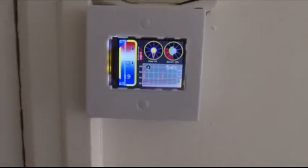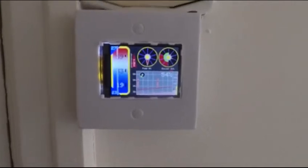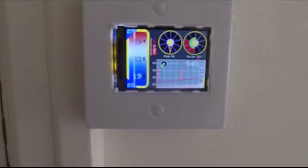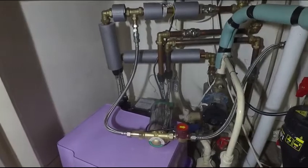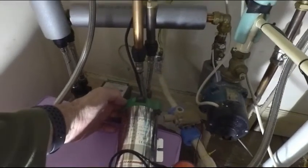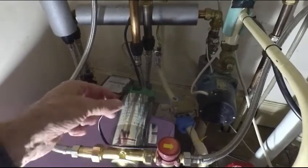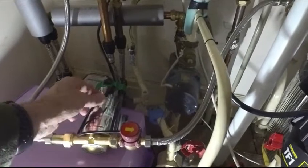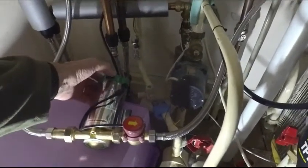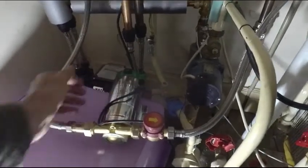It's now about midday. The sun's come out slightly more — it's still a bit hazy — but we're heating at nearly two kilowatts, just over two kilowatts, and 59.25 degrees at the top. So the pump should come on at 60 degrees — fingers crossed. The pump is waiting, ready to go. It's got a switch on the back: on position one it just comes on continuously as long as there's power supplied. On position two it uses the water sensor — which I've got disconnected — but that little flow sensor, when connected, means power is available but it will only turn on when flow is detected through the sensor. So I'll be on position one for this application.